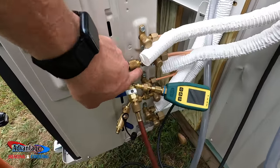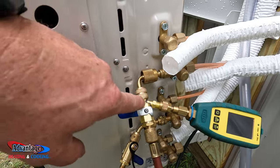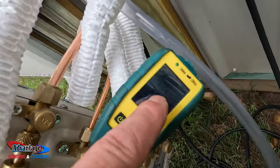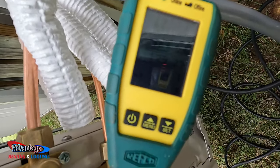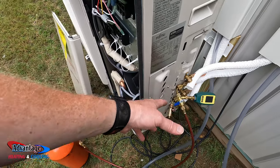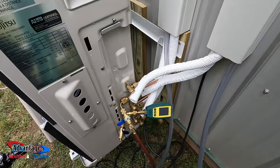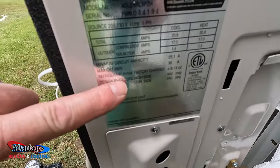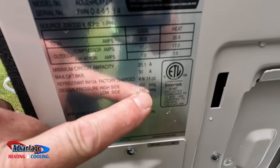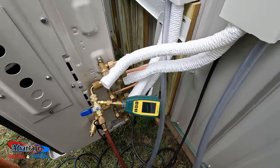This is the style that I have been using. This one is just such a pain to try to get anything in here. I had to build a little tree, if you call it. But I'm at 464 pounds — 464.5. I'm going to let it sit for like 10 minutes. I've been told you're supposed to run these up to like 600 psi for 15 minutes. I just find that hard to believe. Right here — design pressure: 450 psi. 450 to 240. And they said to run it up to 600. Leave it in the comments section below.